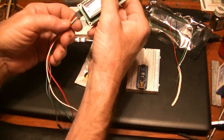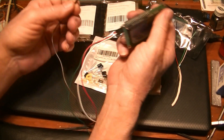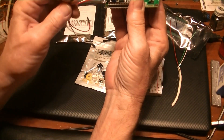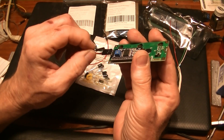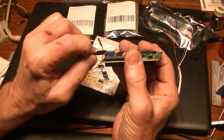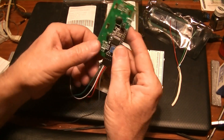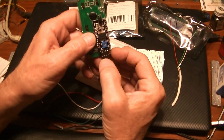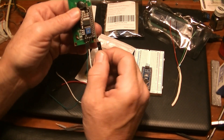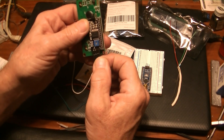You're going to need a pack of these pin connectors — male and female. It plugs right in. They're not really square, they're actually rectangular, so when you see all the silver contacts lined up you've got them in the right way. If you go the other way they won't line up.